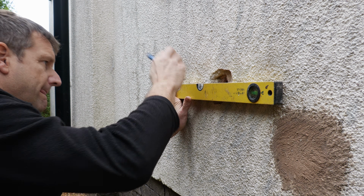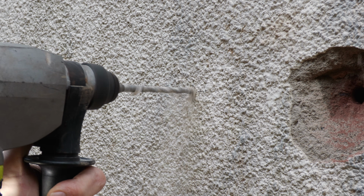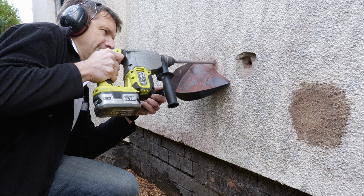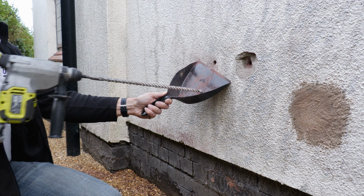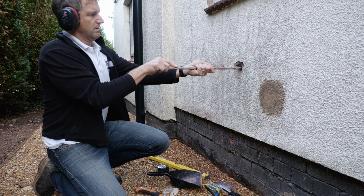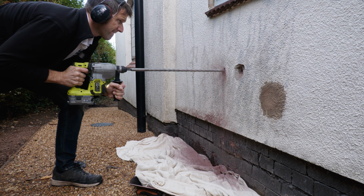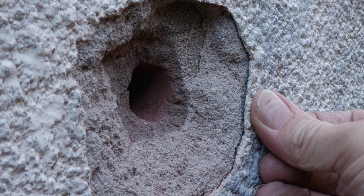But with the external position now marked, I could drill the second hole from the outside, 180mm apart from the first, and this time starting with a much narrower drill bit, guaranteeing a much cleaner hole, before moving back up to the 16mm bit. A bit of spare 15mm copper pipe just about squeezed through, but I wasn't happy with how tight a fit it was, so I enlarged the hole to 24mm and would find out if that was a good idea or not shortly.